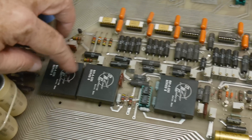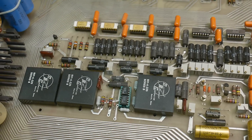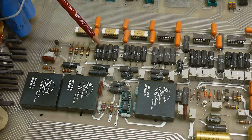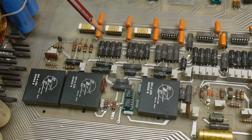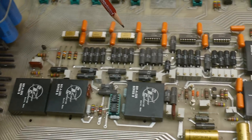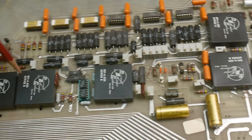What's amazing is how many op amps are in this thing: one, two, three, four, five — all chopper-stabilized amplifiers. I'm curious about why the design was changed. There are lots of expensive resistors, but these are only 0.1% — cheaper resistors than the other unit. More expensive op amps but cheaper resistors — that makes no sense to me. And here's all the FET switching: the BCD input comes into these FET switches and enables the various sections. There are six FET switches and five op amps.